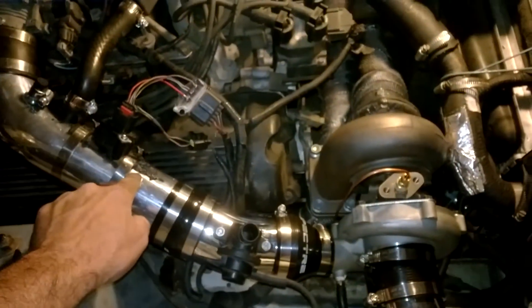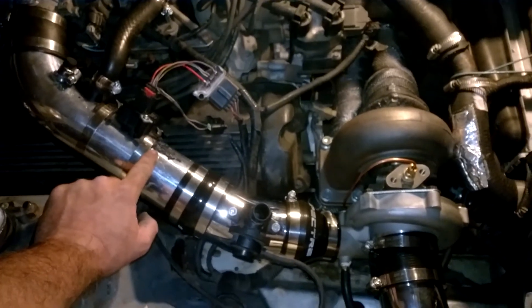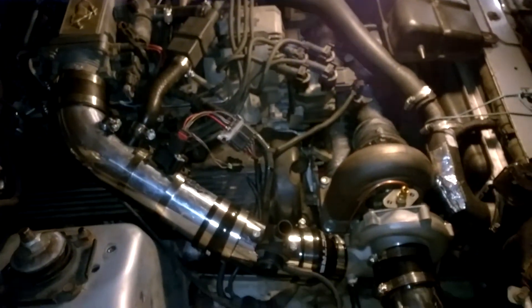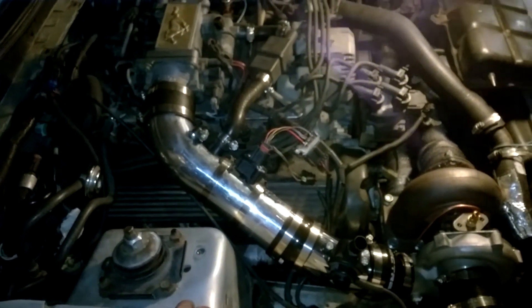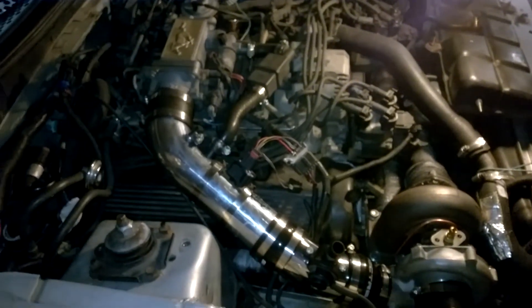So all of that already blew out. I started this up and boosted it too fast, and my silicone didn't seal yet so I gotta take that back off. I used RTV to mount this slot into this tube — would have been fine if I wouldn't have pushed it before it cured. It's only been on there for like an hour.